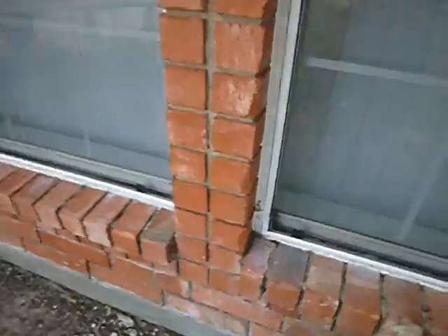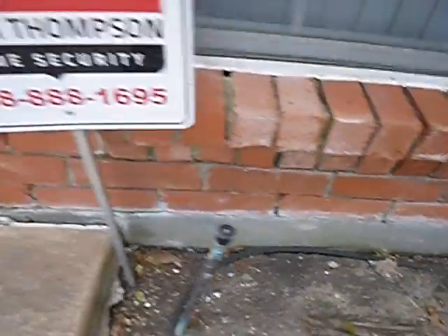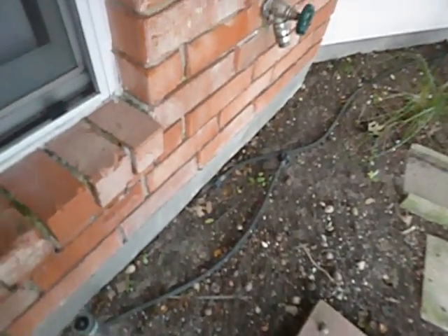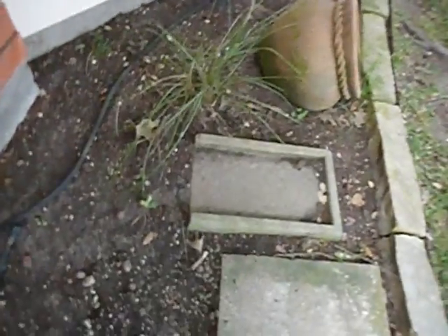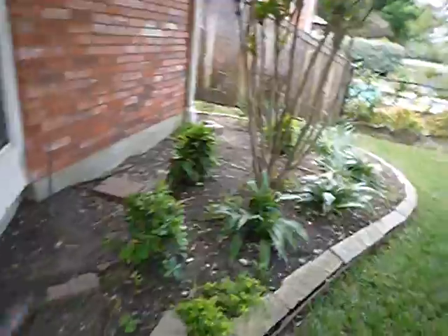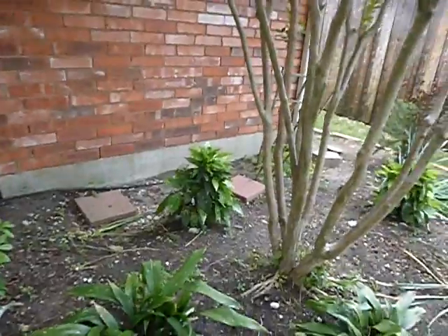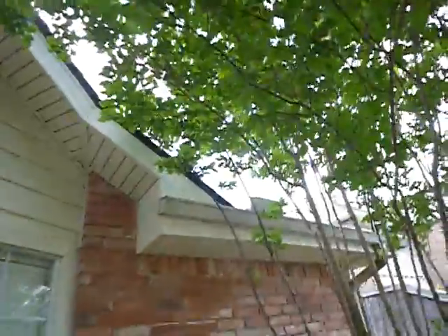What we're seeing right here is called a parge coat — it's kind of like cake frosting, it's decorative. You can't see behind it; there are voids behind it. Termites can come up through those voids, and there could be cracks in the foundation that are not visible. Also, your lawn sprinkler spray heads should not be closer to the structure than 12 inches. A tree shouldn't be closer than 20 to 25 feet to a slab foundation — the roots suck water from your foundation, the roots can expand and cause your foundation to move. These trees are going to cause you some grief.